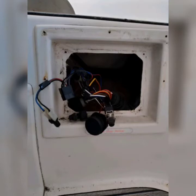The method of fitting that we are going to use in this instance is to break into the Volvo Penta wiring harness that was originally fitted. This has 16 wires within it. We only require 11 wires. The Dragon panel comes with a standard 11-way plug. The Volvo harness had the standard Volvo round 16-way plug, which we had to remove.